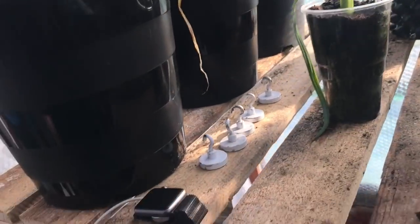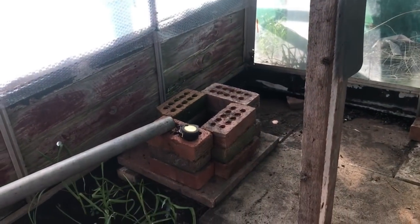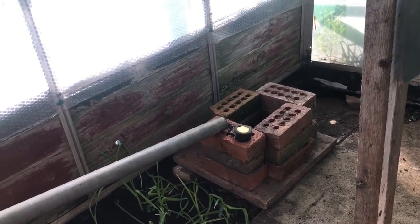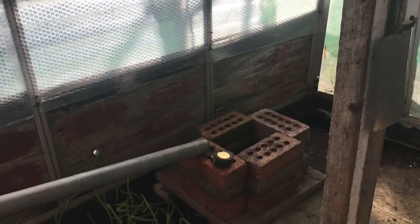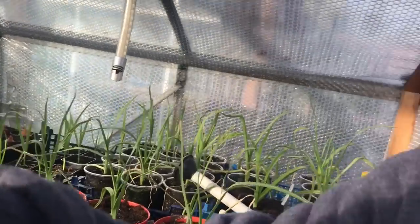Right, to get this fire sorted out, I've moved that base a little bit closer because the pipe work's not as long as what I thought it was going to be. So I've built the platform. The pipes are going to be not level, they're going to be just slightly raised so that the water goes back and forward when the heat's up, it circulates around. But next task I'm going to get cracked on with, I'm going to get on with the tank now.